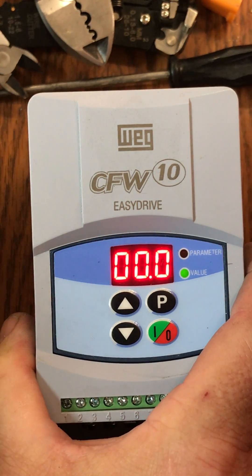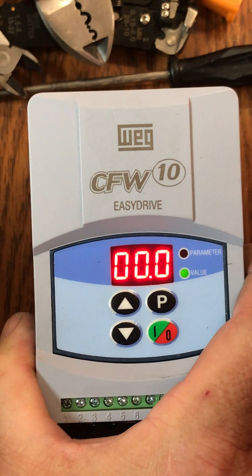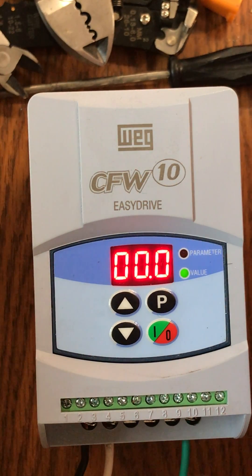We can do a no-load test without a wheel, but ultimately we want our sharpening wheel on the machine to see how it powers up. If we seem to have an issue, we can run back into programming mode. Parameters 100 and 101 are the two that typically can have some difficulty, depending on your power source and how well the amperage is coming in from the wall. If it's tripping out on startup, go to the 100 setting and increase that number from 35 up to 40 or 45 in 5-second increments. If it's overloading when trying to stop and brake, go to the 101 setting and move that from 35 up to 40 or 45, again in 5-second increments.